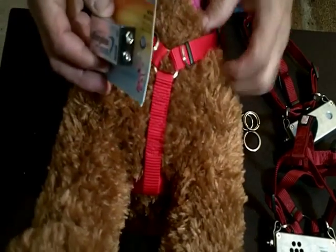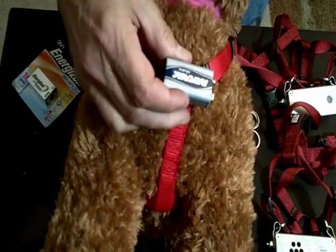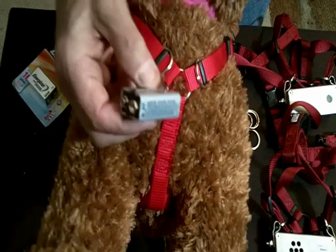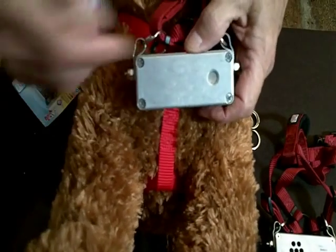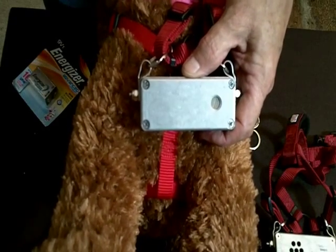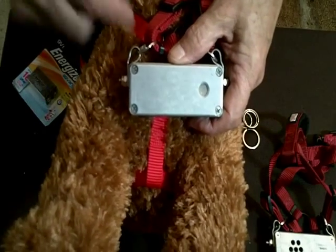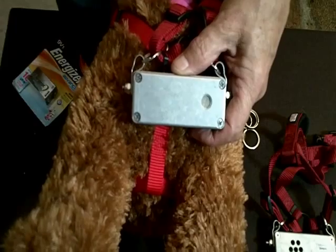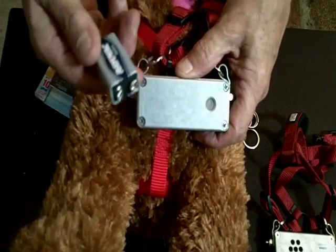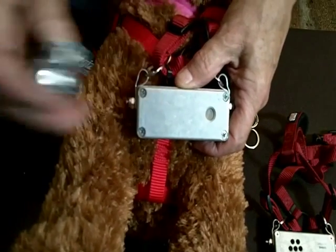These lithium batteries — the units made the last 10 years — it probably can last a good bit longer than that. These lithium batteries in an S2 are good for three to four years. The alkaline battery, common alkaline battery you can get anywhere, is good for about a year and a half. When you get this with the lithium battery, put a note on something like a kitchen cabinet or wherever with the date when you want to replace it. For safety, just say three years — not four — and put that date for battery replacement up somewhere you see it every day. When the date's getting close, put a new battery in it, alkaline or lithium. If you use alkaline batteries, when you replace your smoke alarm, replace this — service the dog when you service the smoke alarm and you're done.